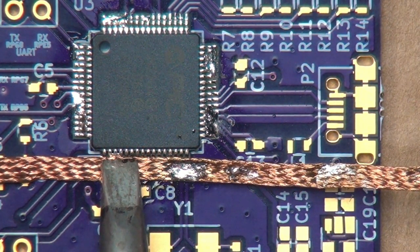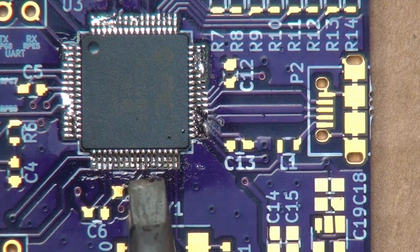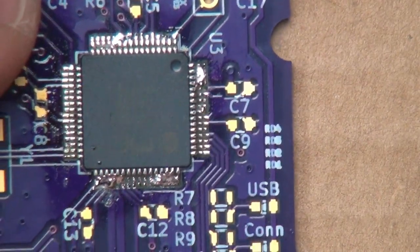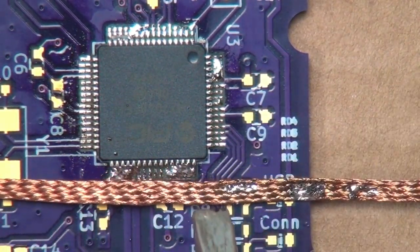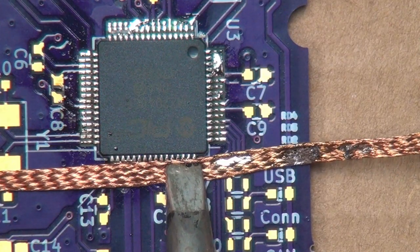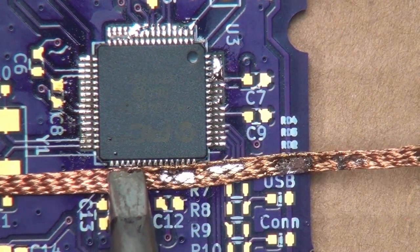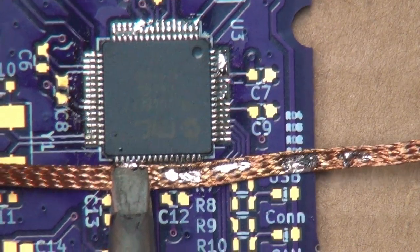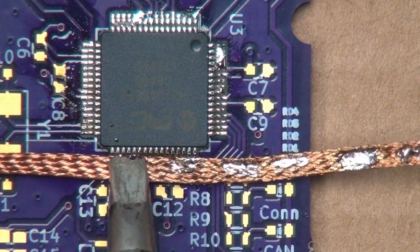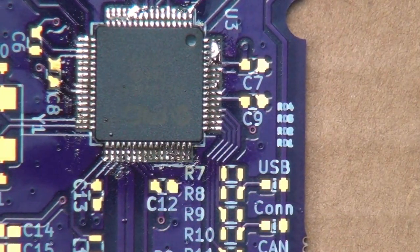And so you can actually see right when the solder melts and wicks into, whoop, right there. Do you see it go whoop? Because solder has some very nice surface tension properties that really help with doing this kind of surface mount stuff. And again, whoop, you see it just disappear from between those two pins like that, and then touch it up over here. Like that.